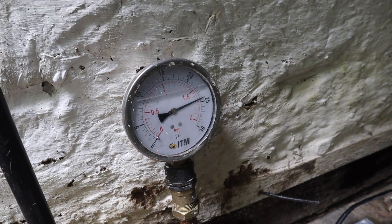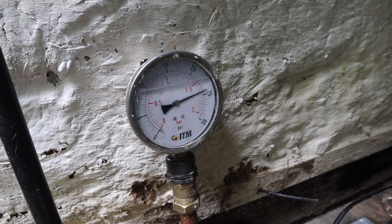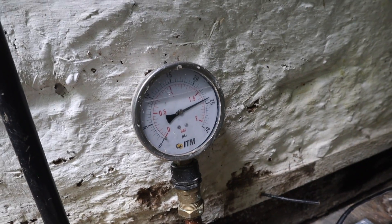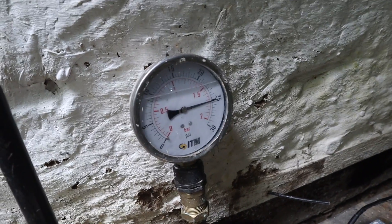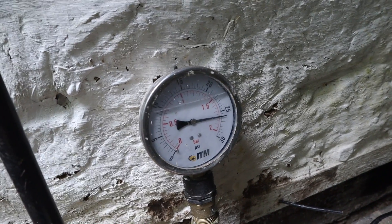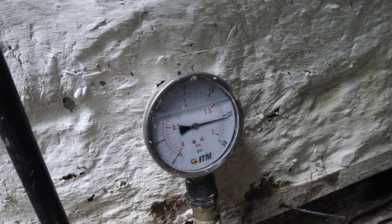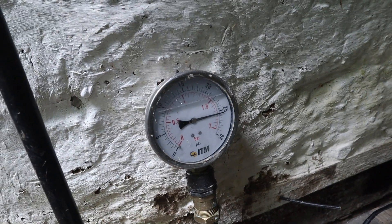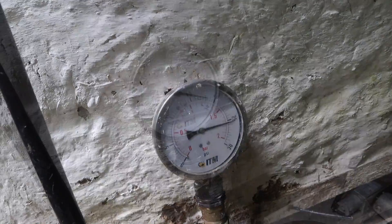We're just down at the turbine now watching it as it fills up, just to see if we get any more pressure. I'm going to let it fill with everything off and see how it does. We're at around 25 psi, which means we're getting fairly close to where the standpipe is now. It's just below the standpipe, so let's see how it reacts — once it gets to the standpipe we should see the pressure go up quickly because the air will be able to get out easier.